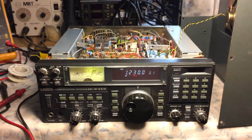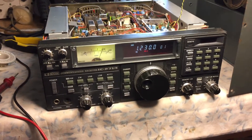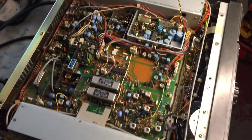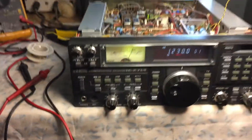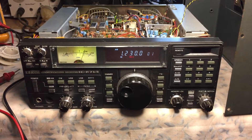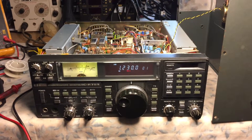What I'm going to do now is give this radio a full servicing — clean all the controls, DeoxIT, take apart the front panel, and I'll probably give it a bath, it's filthy. Inside it's just dusty, so I'm going to blow it out. I don't believe it needs a capacitor swap — don't mess with it if it's working. Instead of digging into the radio further, if it's playing good and seems to have good sensitivity, I'll test the sensitivity after I give it its servicing.